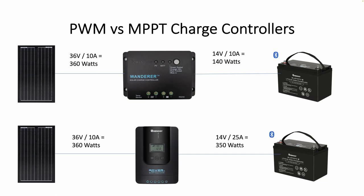Out in the country there are intersections with a flashing red light above the stop sign — there's a small PV module, a PWM charge controller, and a gel cell inside that little box. That's enough to charge the battery and keep that big red LED light blinking 24 hours a day, seven days a week. They work great. But if you're wanting to maximize it for a field day or for your trailer, definitely go with the MPPT system.